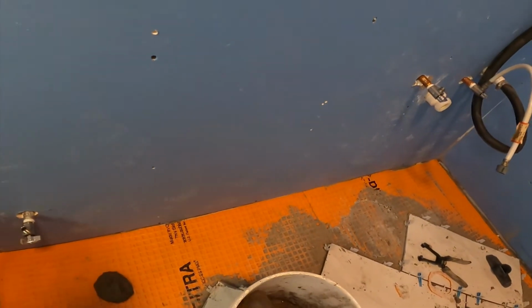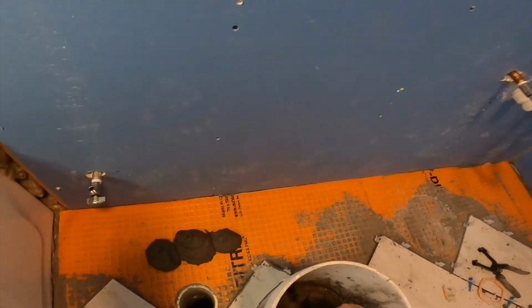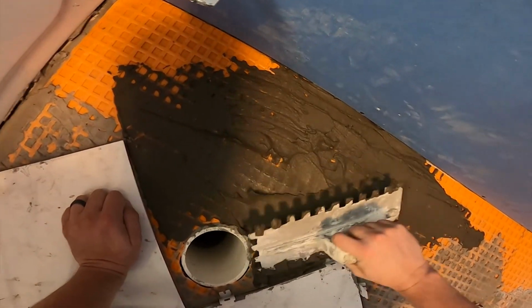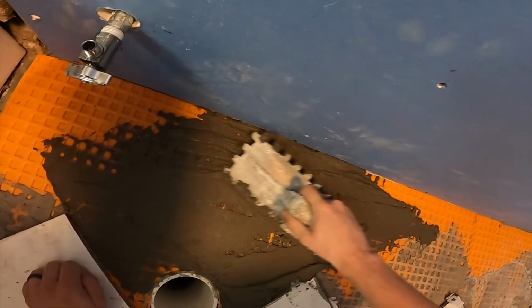Now I took 2 days to tile this floor because once I got the main portion of the floor done, I couldn't put any weight on it, otherwise the tiles would shift. So I left this row of tiles for the very last on the second day of tile work. I heavily recommend, if you're going to be using these large format tiles, to get the leveling system that uses little plastic wedges and clips to make sure that the tops of the tiles are completely flush with one another. It's an extremely fast, easy, and effective way to make sure that all your tiles line up exactly the way you want them.